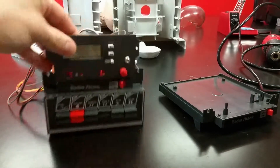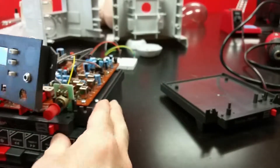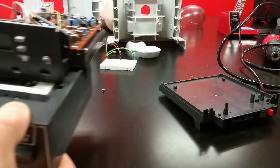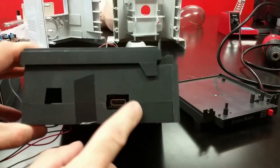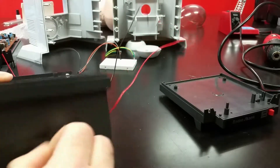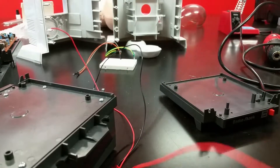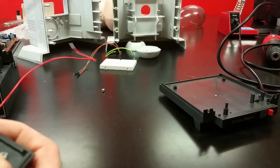Here's what the drawer looks like when taken out of the robot. It has a PC board on top - this is the clock interface. When you pop it open you have the tape deck area. I took all of the tape deck guts and all the buttons out to get a hollow drawer, and that gave me room to put in all the new electronics. I cut out a place on the side for the HDMI - right now it's just taped together - and cut a hole in the bottom to get the wires through. Interestingly, the tolerances are so tight that tape on the drawer won't even let it slide.